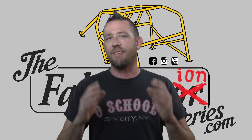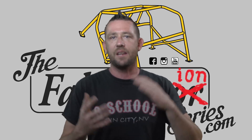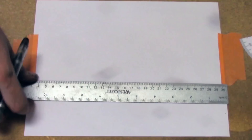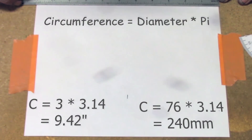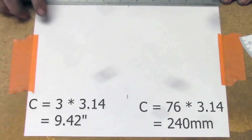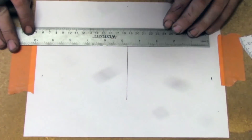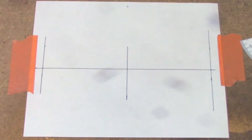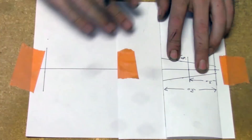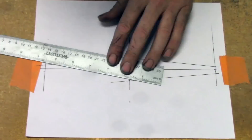It's extremely important that you know how to calculate everything entirely by hand, in case you don't have all the fancy tools, software, and equipment to do it all for you. But here is exactly how you cut all of this out, how you measure it, how you draft it, how you make it all happen entirely by hand. Now, set your pie draft aside, grab another piece of paper, and you're going to need to know the circumference. The circumference of your tube is the total distance around the outside of it, which is calculated by: circumference equals diameter times pi. So for all of you in the US, that's 9.42 inches, and for those of you using metric, those measurements are on the right. The total distance is 9.42 — you need to know the halfway point across that one, and that's your center line. We're basically laying that entire circumference of the shape of the pie out on a flat surface. Mark out from the edge of the paper, draw a line right down the center of it. Go ahead and grab your draft of your piece of pie, because this has your exact measurements on it. The small ends go down on the outside, the big end goes in the middle of it, draw a line to connect all of them, and there is your piece of pie.